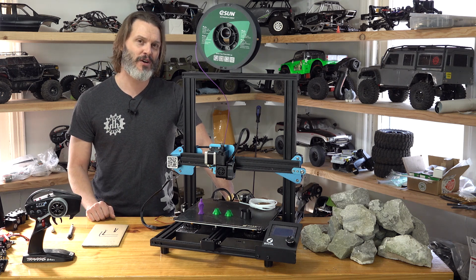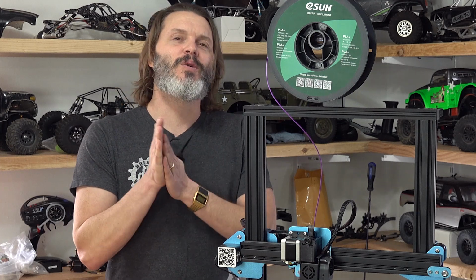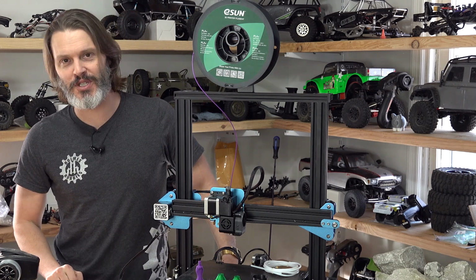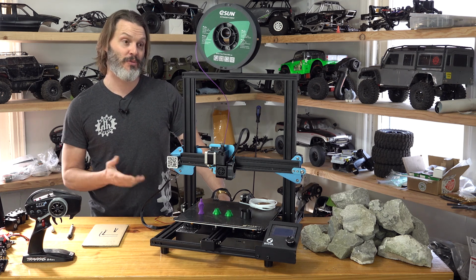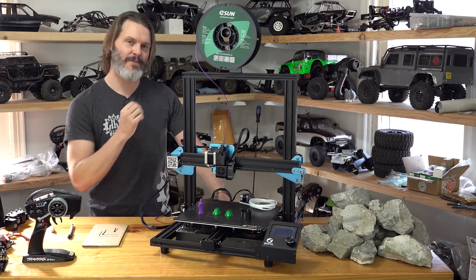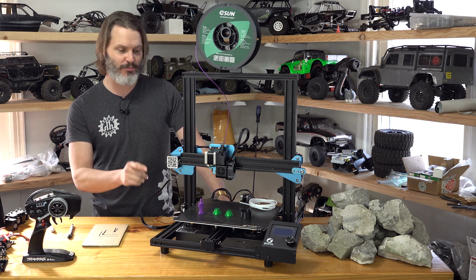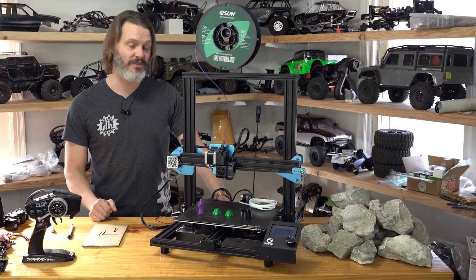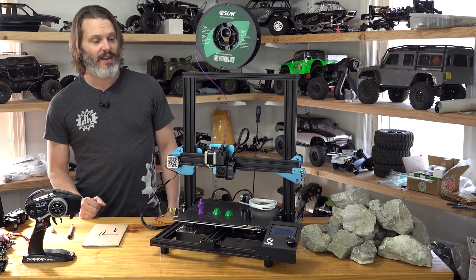If you saw on previous videos, I have a, oh boy, it's been so long. What was that printer you had too? Maker Select. Monoprice Maker Select. Yes, the Monoprice Maker Select is what I've printed a lot of stuff on, and it has this salmon skin look to pretty much everything that comes off of it that prints in a straight line across the bed in either X or Y. It has this ripply salmon skin effect, and while it's not pleasing to look at, there's absolutely no functional problems in it. But this printer, from what I have done so far, has no salmon skin on it. So I don't know if it's just improved stepper drivers that have less harmonics in it, or what they have done to this to smooth it out, but I'm very pleased.